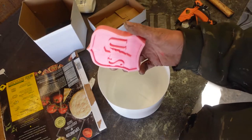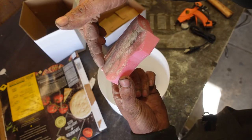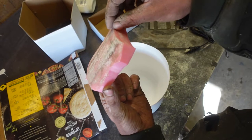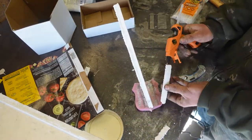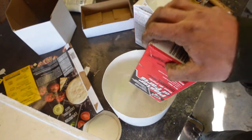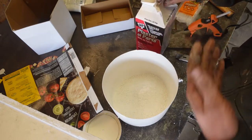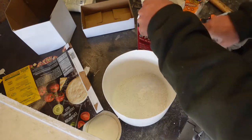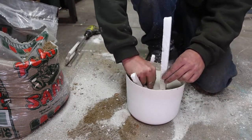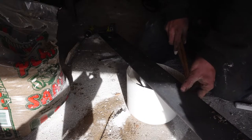For the lost PLA casting I'm going to try with this piece — I'm going to set it in plaster inside this tub at kind of an angle. My gate for the metal will hook up back here, so the metal will come in and rise up through here. I'll have a couple outlet gates here as well. For the actual plaster, we're going to do one part plaster, one part sand. The sand just makes it more porous and heat resistant, so the water can evaporate out the sides without it blowing up. That piece of flat bar should hold it in place. I'm just going to be tapping the sides to try and shake some air bubbles out of it.